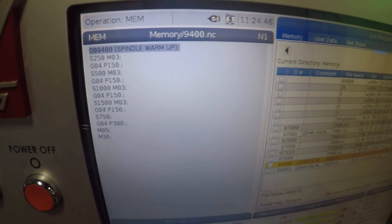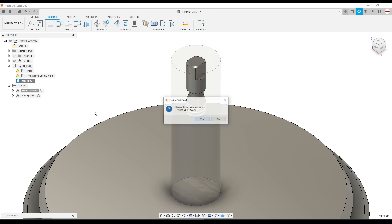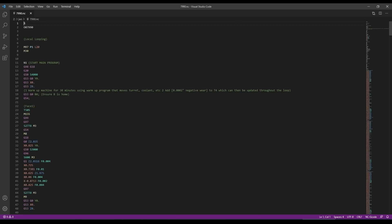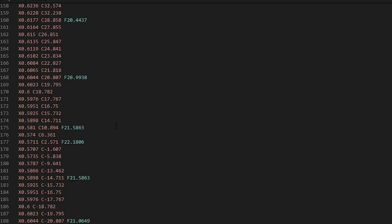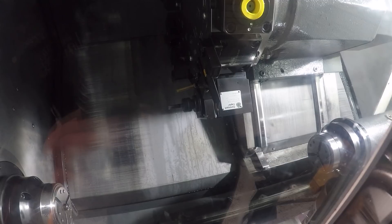The next thing is warming up the machine itself. We have a warm-up routine that actually came with our lathe — it's relatively short and we run it, especially if we haven't run the machine for a couple of days. But we also have a different warm-up routine that we run much longer when we really want to bring the whole machine completely up to temperature. So it's not just the spindle, but all the cast iron, the coolant, and other things that generate heat — from coolant pumps to driven tool holders. Heat isn't necessarily a bad thing; it's changes in temperature. What we want to do is find the temperature and environment that the machine is stable at, and then it will be kind to you.